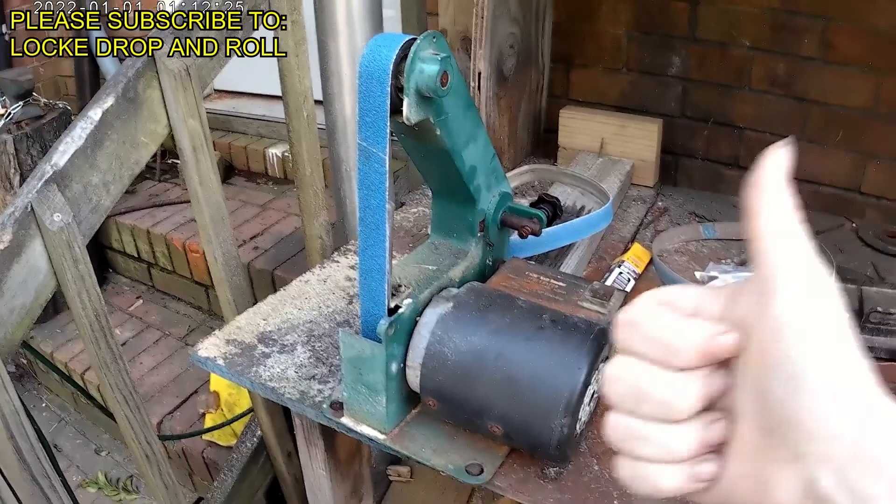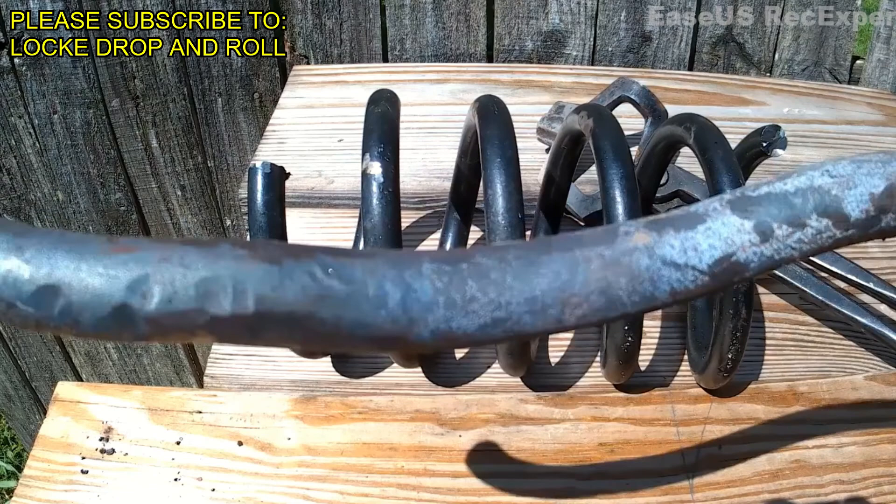As you can see, I've welded my spring steel after chopping off a piece and heating it to straighten it out. You can also use blacksmithing tongs as well. This is me turning my forge on — I don't like to go over 0.5 on the pressure scale. Letting it warm up a little bit.